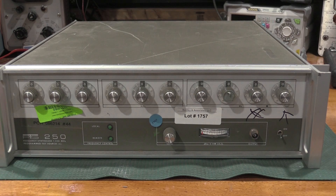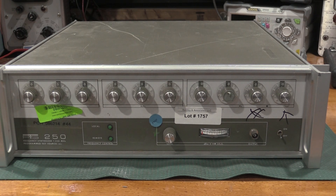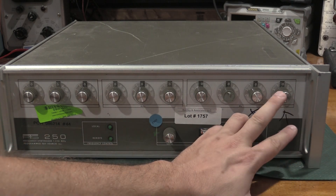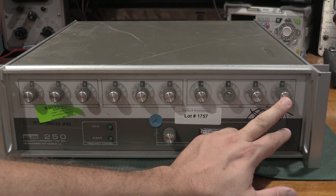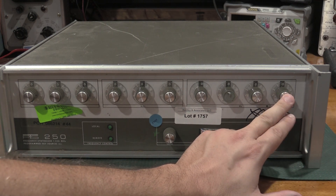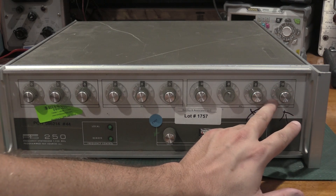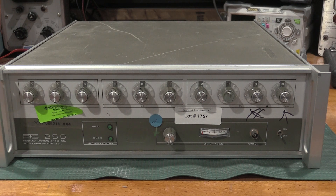PTS uses a mix of digital as well as analog components to synthesize the frequency, and we have an adjustable frequency from 1 to 250 MHz. This one does have the option down at the bottom, so this dial is populated. If you don't have the decimal point option, which would be a 100 mHz adjustment, this knob will be here but it'll be blank. So this one is optioned up, which is kind of cool to see.